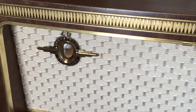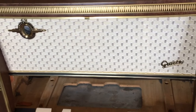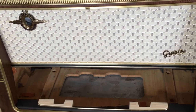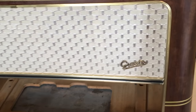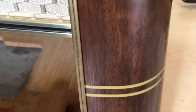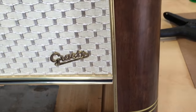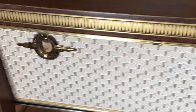The gold trim all the way around the sides was cleaned and polished and then put back in with some glue. Be very careful with the glue you use, because if it spills out onto the wood of the cabinet it tends to fade the clear varnish — it reacts with it. So you've got to be very careful with what type of glue you use. Perhaps some experimentation is advisable before you go in all out.